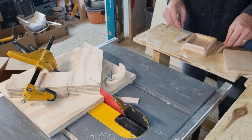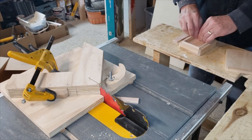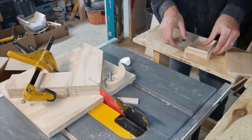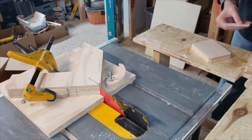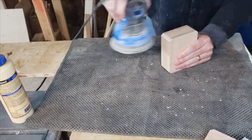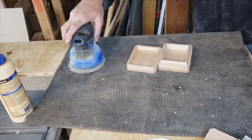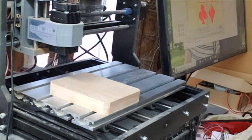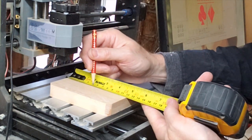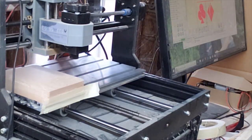I take out all the pieces since they dry-fit nicely and just glue them in place — they don't need a lot of glue since there's not much pressure on them, but I glue them in so they don't go anywhere, wipe up the excess glue, let it dry, and move on. The next step is more sanding. I use three grits: 120, 150, and 220 — sometimes up to 320, but usually 220 is good enough. Then we're off to do some laser engraving. I've got the pattern on the computer screen and I'm just finding the center of the box, then letting the laser do its thing.